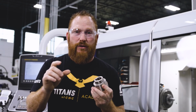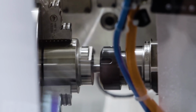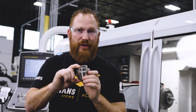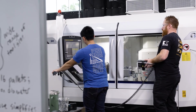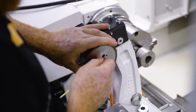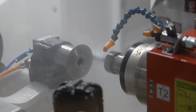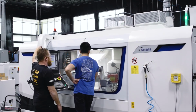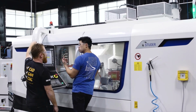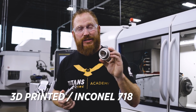You can imagine a wheel that's 2 1/4 inches long coming into a part that's about 2 1/4 inches deep, running at 32,000 RPM. There's a lot going on. We had to make sure that everything was perfect before we started. Since we're using the ID wheel, we're using a rotary diamond dresser on the swing arm to be able to reach it and dress our ID wheel. Using the correct geometries, we trusted our machine, the Studer S41 from United Grinding, more than capable of hitting millionths of an inch. We got as accurate as we could, brought the ID to its nominal dimension.